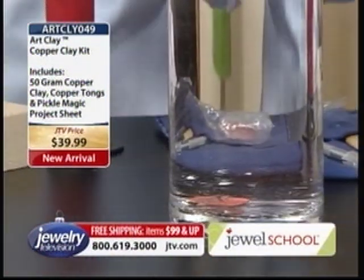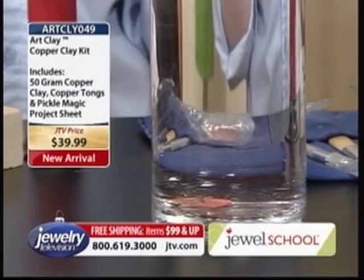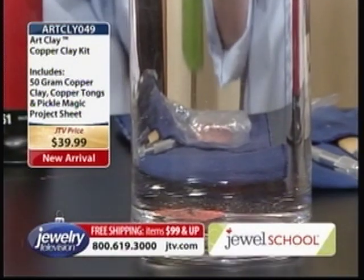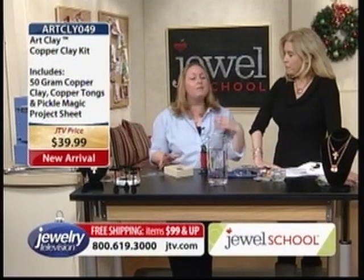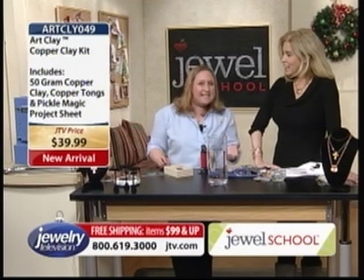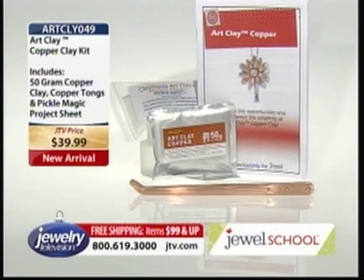And then you can see just a little bit of black speckle kind of floating in the water. That black speckle floating in the water was the oxidation. We have just successfully removed about 90% of it from the piece. So I could bring this out and kind of start brushing it up, and it will immediately start looking like fantastic copper. Just like brushing the Art Clay Silver, we're going to brush the Art Clay Copper and turn it into exactly what we were hoping for.